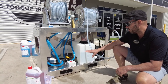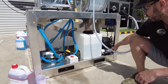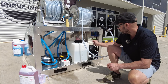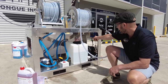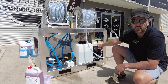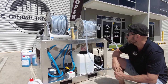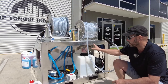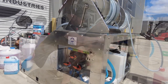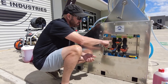The skid includes the Delavan pump, the Banjo flush valve, the on-off switch, and our 25 litre soap tank. The 12 volt Everflow pump here is 8.3 litres a minute and will be hooked into our roof treatment for spraying Wet and Forget. A 120 amp hour battery drives both pumps, and our 12 volt IP65 charger tucked underneath controls the power management. We have a stainless steel hose reel feeding the roof treatment system and a soft wash reel for the soft wash application. The brains of the system is the Midwest V4 proportioner.